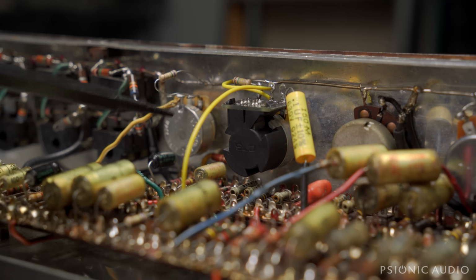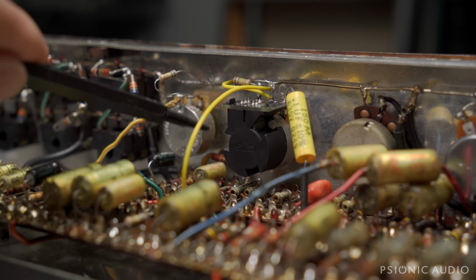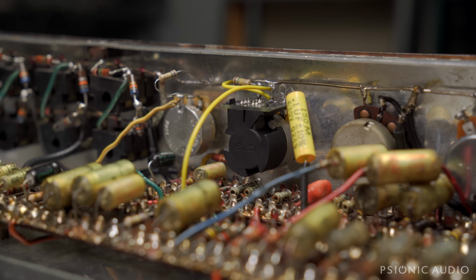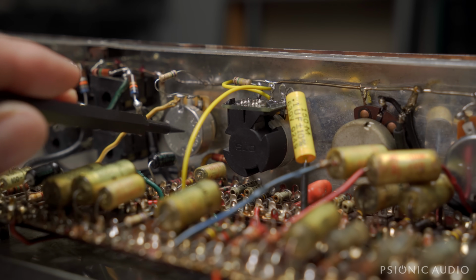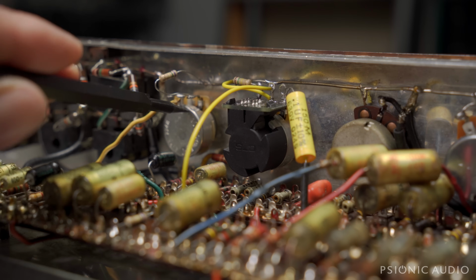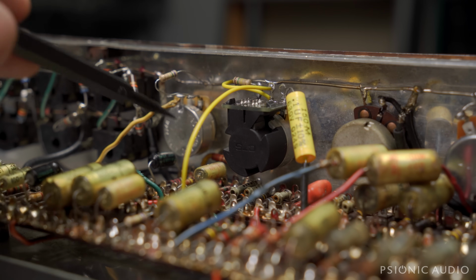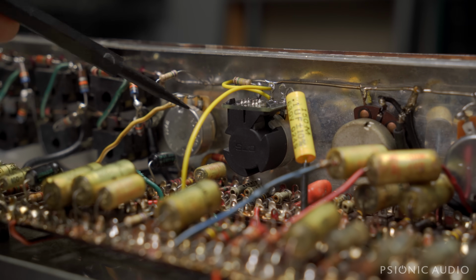And here, rather than a three-position switch with 3 different resistor choices for the tremolo speed, I've got a 3 meg CTS reverse audio pot with a limiting resistor to set the max speed, which is what you'd find in a Fender. Unfortunately, this relatively expensive, nominally 3 meg CTS pot is only about 2.4 megs, so I'm missing quite a bit of the depth that I was hoping to get. I've got another different 3 meg reverse audio pot on order, so I can have this minimum slow speed that I want without sacrificing the maximum fast speed.